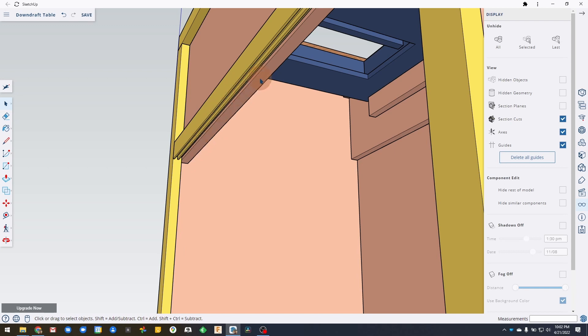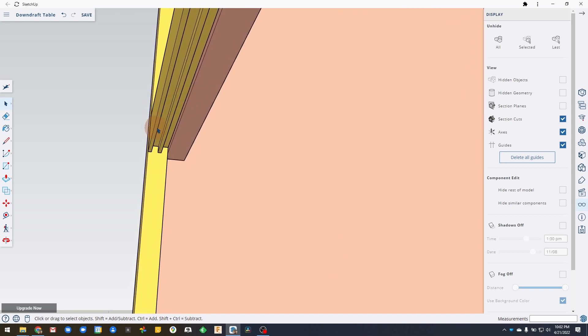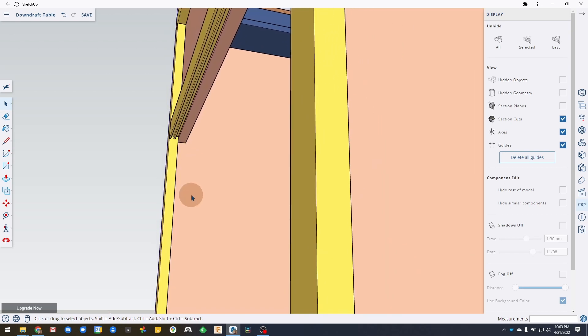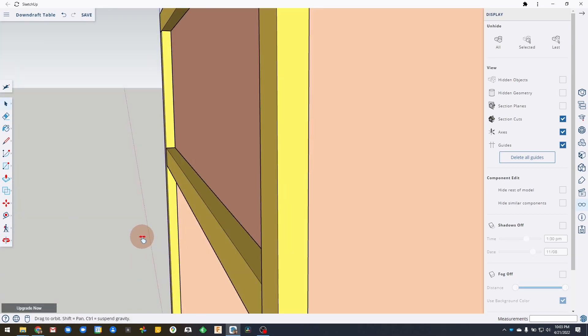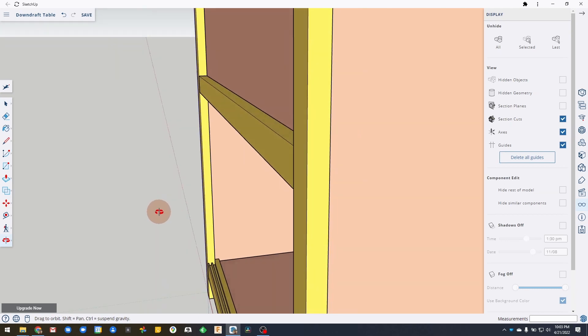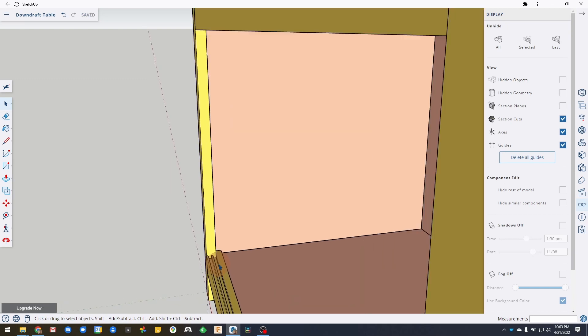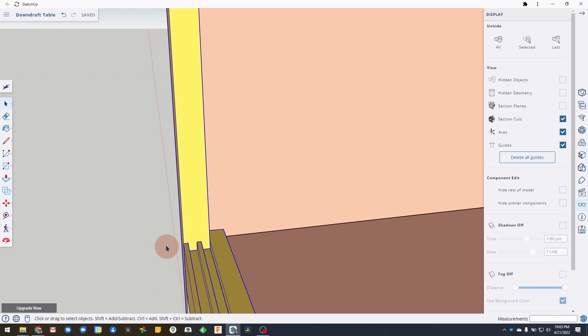On the top, this plywood piece of the case provides the back edge for the groove. The way the grooves worked out, with the three-quarter-inch thick piece of wood, I've got an eighth of an inch and then a quarter-inch groove, so I need a backstop for that back panel — and this plywood provides that backstop. On the bottom, the plywood panels I had available for my doors weren't quite tall enough for the opening I left, so I had to make an extra little strip to provide that holding piece for the back groove on the bottom.